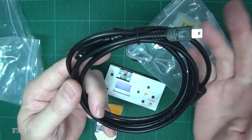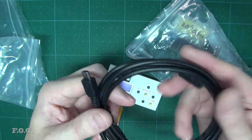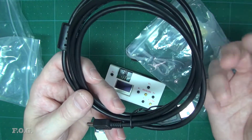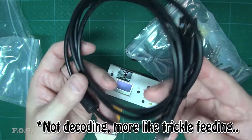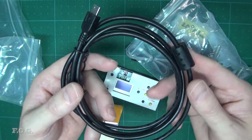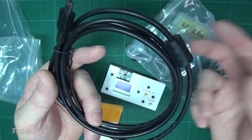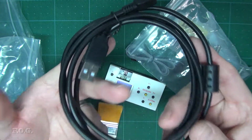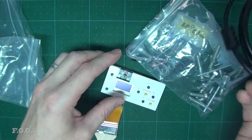One way is to use a computer with a piece of software that directly is telling the controller where to position and move it. So it's effectively decoding the G code and sending the specific coordinates down this cable, or step-by-step commands down this cable. I really don't know the specifics of it, but anyway, the key memory for driving the events on the G code exists within your computer, and you drive it over the USB through that little Arduino Uno type device.